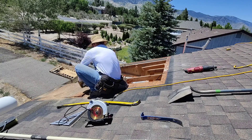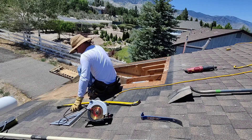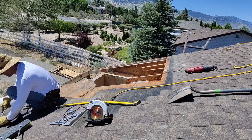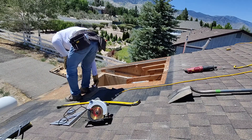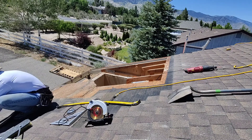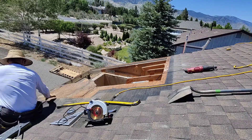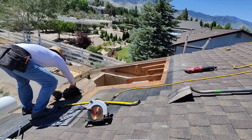This is the moment where I realized: what's going on here? Why is the end of the plywood now hanging in free air and not supported by the truss? It really was a truss that had a big old curve in it. So now I'm taking more shingles off and more underlayment is being removed. This time I paid a little more attention — on the end of the roof right next to the gutter, you can actually see the rafter tail, so I could really make sure I cut along the right line.